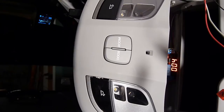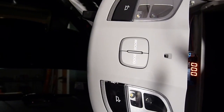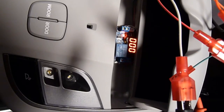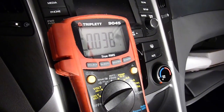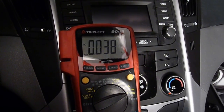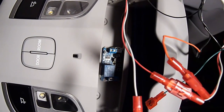Five seconds. And boom, camera turned off. So now the only thing left is the light and the timer module. The total current draw for those two devices is 38 to 39 milliamps. So once the timer kicks off, the maximum draw from the devices left on is about 39 milliamps. As soon as you turn it off, everything drops to zero — there's no current draw whatsoever.